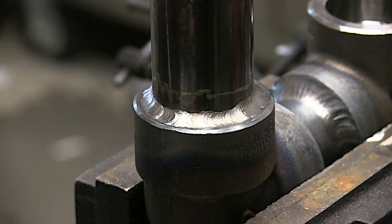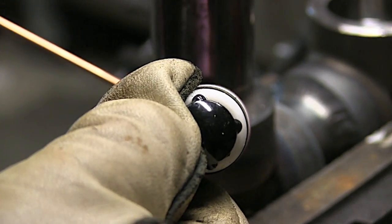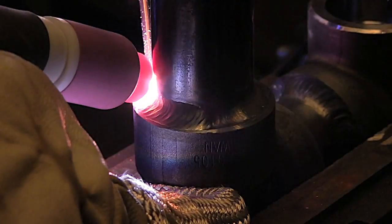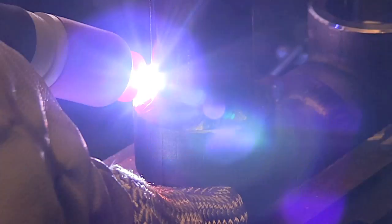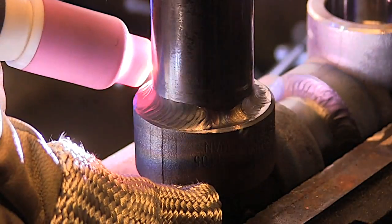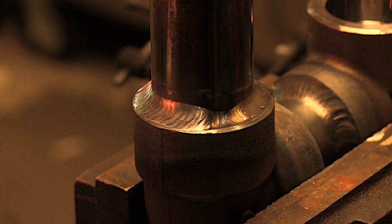That's one pass. Coming across with the 1/8th — 3.2mm — filler wire and trying to mimic the same weave motion as walking the cup, just to get some uniformity. It's slightly different because your electrode angle isn't walking back and forth, but sometimes freehanding socket welds is absolutely necessary — in a tight spot with a bunch of fittings next to each other, you just can't move the torch. I'm using a full-size gas lens cup here — not a stubby — because I ordered some from a company and I'm trying them out before I put them on the store.